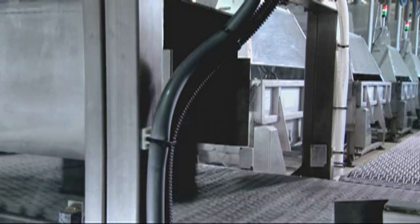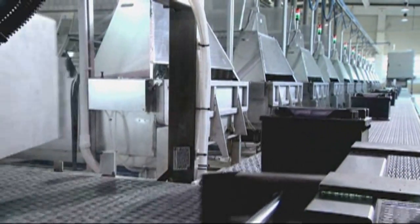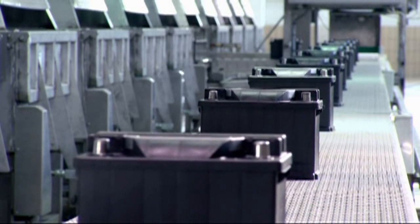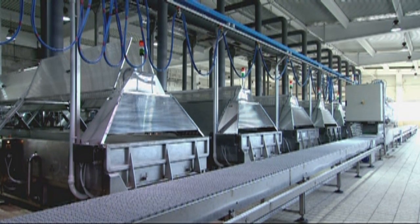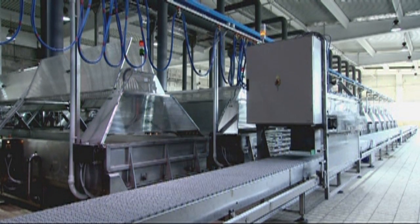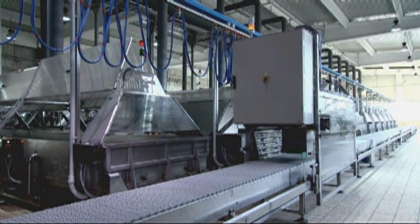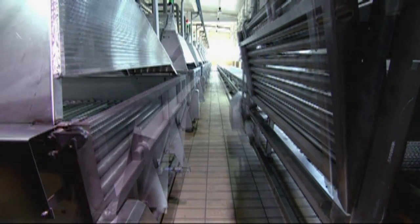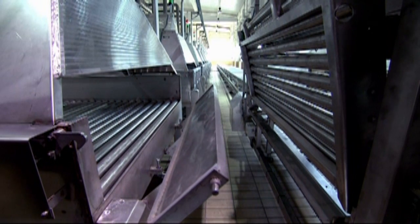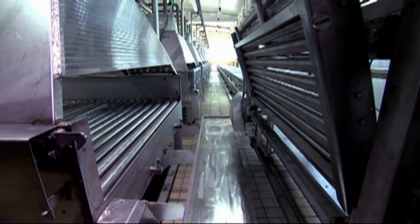The inline rotating unit aligns each battery with respect to polarity and type — 180 degrees in case of polarity change, and 90 degrees in case of change from car to truck batteries. The water baths are loaded automatically. The loading shuttle moves along the conveyor to the water bath to be loaded, and the gate opens ready to accept batteries.